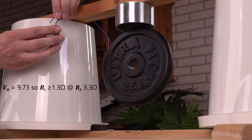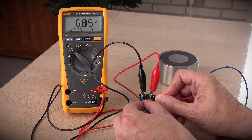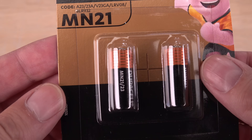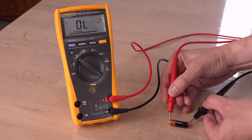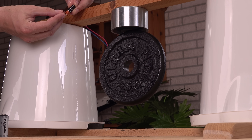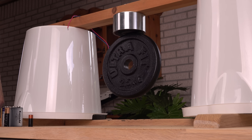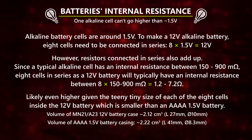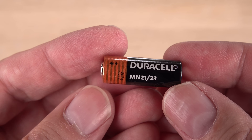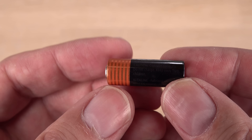It makes sense, since we know around 7.5 volts is required to drop this weight, and none of them could deliver that to the electromagnet. Maybe this joker will do it — a tiny 12-volt alkaline battery. Not even a wiggle. A 12-volt alkaline battery is made up of eight 1.5-volt batteries in series, giving it even worse internal resistance than the 9-volters. 12-volt alkalines are only meant for really low currents.